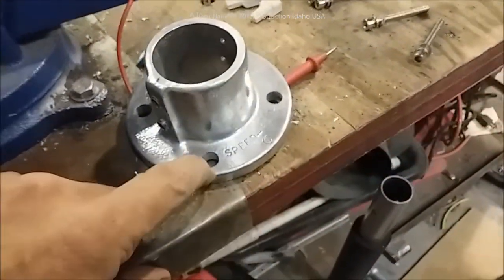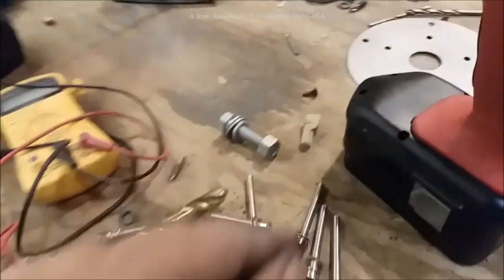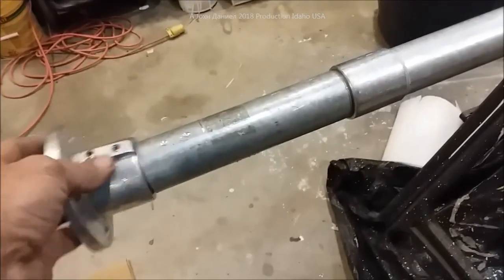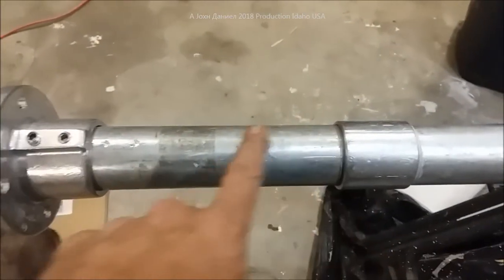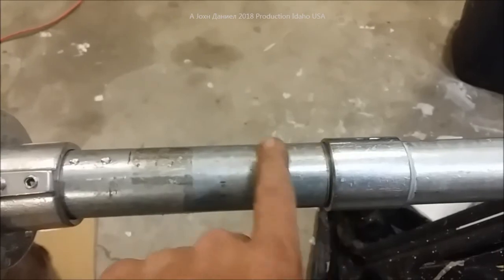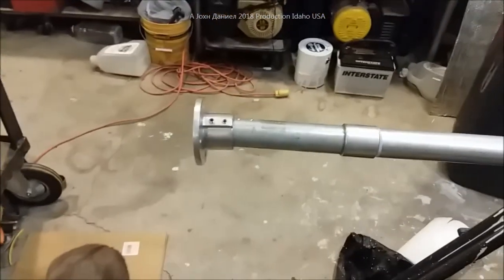So we're going to walk that half-inch bit in there and get that cleaned out — these are seven-sixteenths right now and when we bring them out to half inch, this is going to bolt up using the original hardware from the company that made the PMA. Then she's going to go ahead and get these blades put on when I mount this over here on the pipe. The reason I use the short piece is: look where the wires are — if you ever need access, you can just unthread this. I've used it so I can put the long pipe in through the roof of the building and then walk up with the PMA in the short piece and just drop it in there.